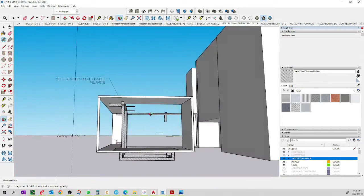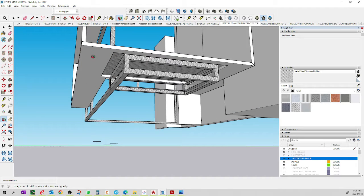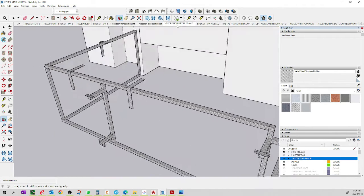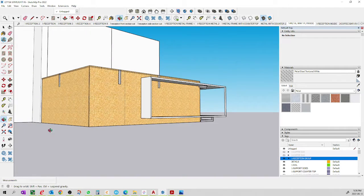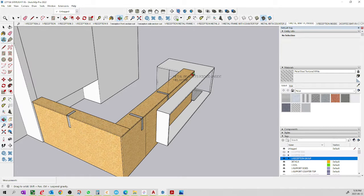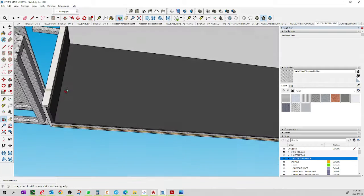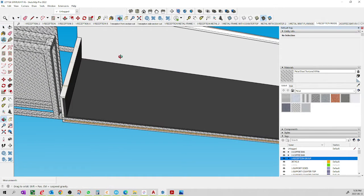The cabinet is sitting on the plate. It's not clear yet whether this detail is going to be a small strip or a cutout inside. On top, we'll put plywood on top of the frame, then metal brackets to hold the top piece, since it's a 10-foot span. The interior finish — she doesn't want to see any plywood or build-up, so the 45s have to finish cleanly. The stone is then measured and the 45 cut is applied.